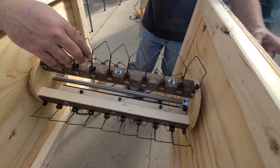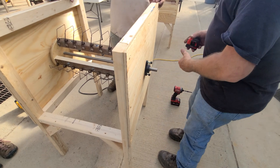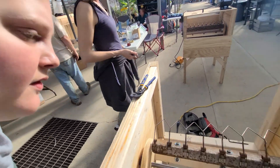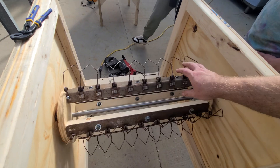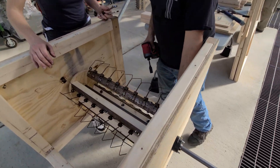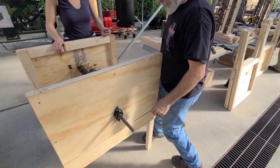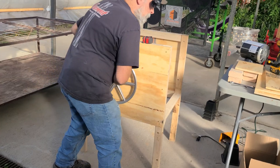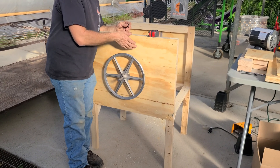Once you get that set, lock it. Give yourself at least three inches on your pulley side so you can get the pulley on. The key just keeps it locked. You have to have room on this side to get your hand in there to tighten the bolts. Lock this to the shaft, then tighten the sides up. I still might have to bump it in just a little bit because when I put the guard on — I had it set — there's about a half-inch clearance between this and the guard itself.